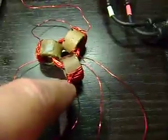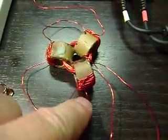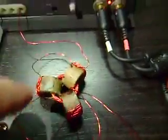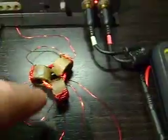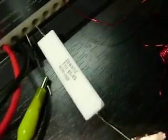I have 14 turns of 26 gauge wire on the outside of each one, and then they're put into series. Coming out of the amp to that one, it loops around, comes over here, and it's hooked up to an 8-ohm resistor — a non-inductive resistor from Radio Shack, 20 watts.